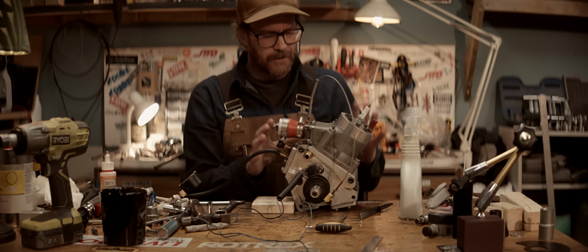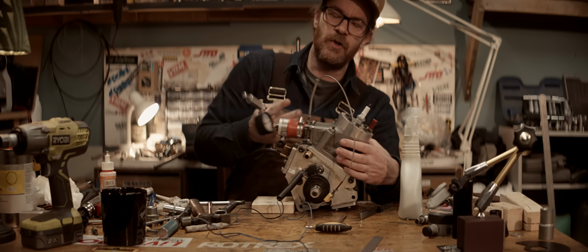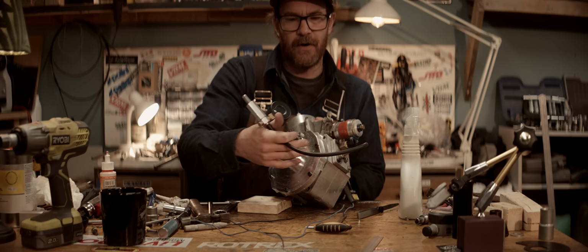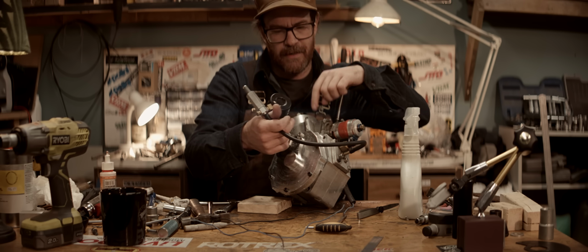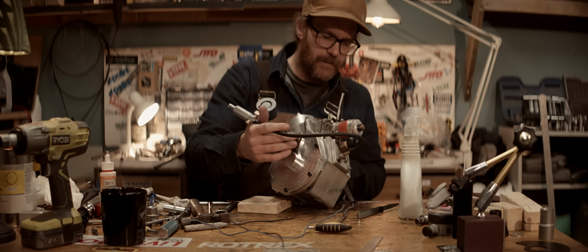Welcome back to my garage. Last video we reassembled the engine with the new rotary valve assembly. Much thicker parts, and we deleted the seal in here. There's just a tiny gap now between the axle and the actual aluminium surrounding that axle, so hopefully less friction.